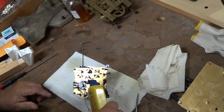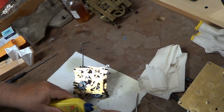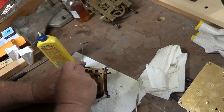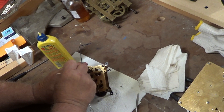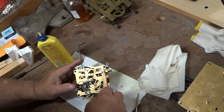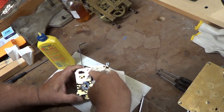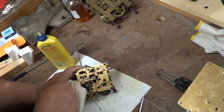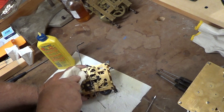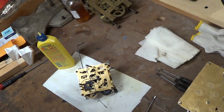Once again, you're going to be tempted to squirt this in there — don't do that. Use the cleaning swabs. You have to get this off of your gears right away. Somebody cleaned this a long time ago and it left a bunch of chemical on it and it ate through the plates and the lacquer coat. You can use a hair dryer to heat these up a little bit and make sure all that fluid is out of there. That's basically how you clean this clock so you can troubleshoot.